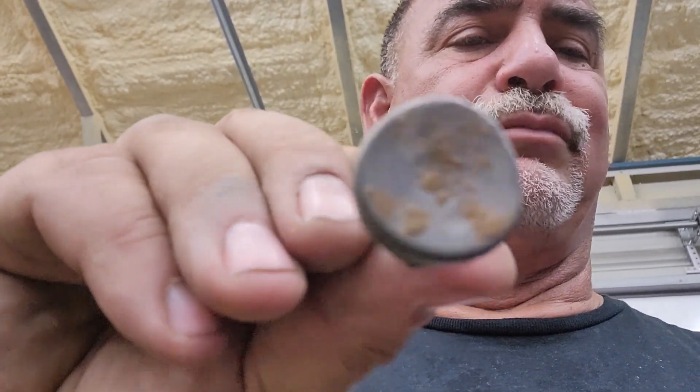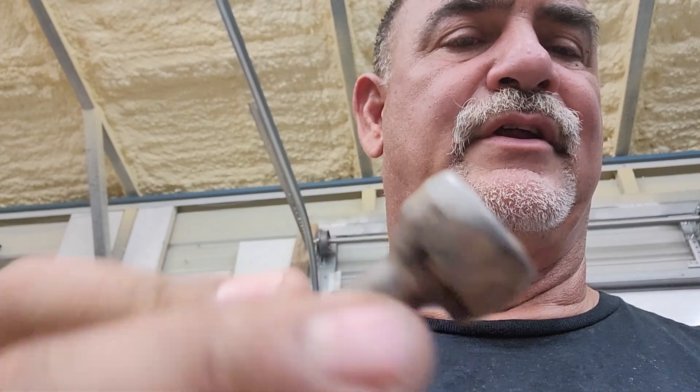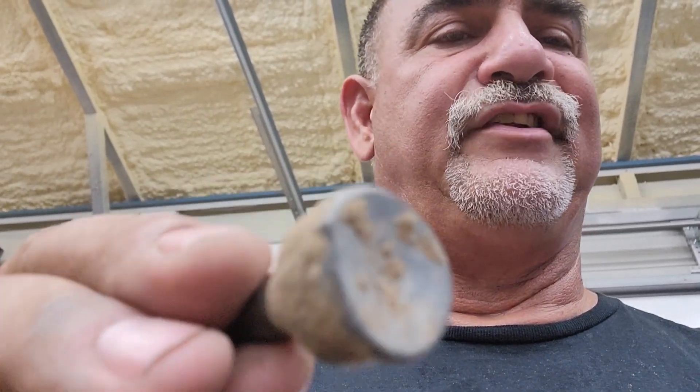When a tooth goes too bad, like this one here — it's oblonged — this green tooth is a candidate to be re-tipped. I'll put links in the description. I use Whit and Sons, but other guys use Jeff's Sharpening. I'll look them up and put them in there so you have a reference point whether you want to send them out to be sharpened or re-tipped.